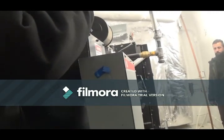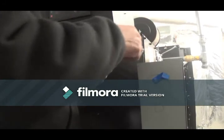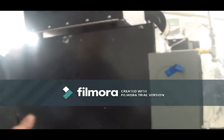Yeah, basically what happens is that once I open this, breakers have lugs on the bottom which are connected with an Allen key. And every time you service, take off, put on, take off, put on, eventually they wear out. With cam lock, all it is is a wire, you put it inside, you lock it, and those things almost never wear out.